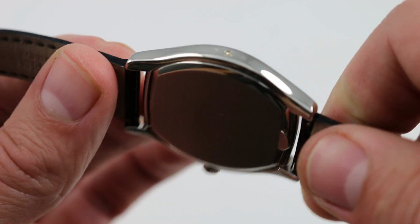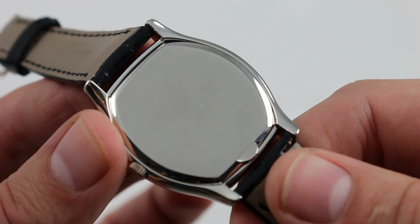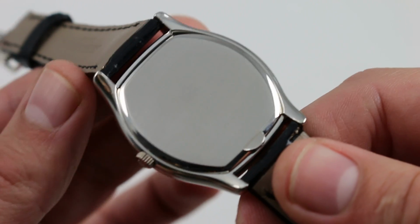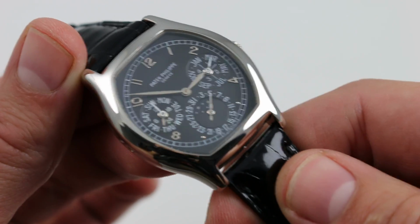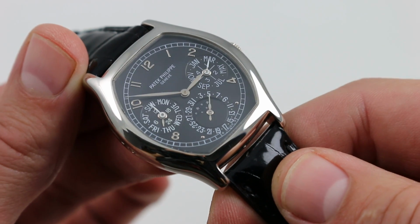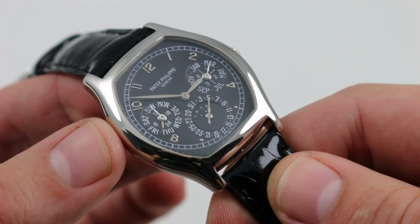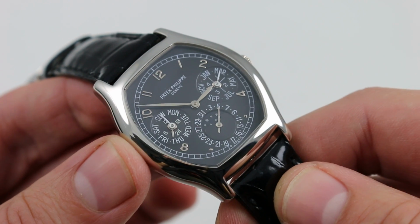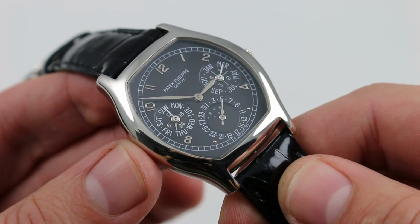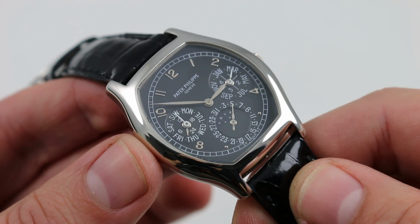Now, underneath that snap-on case back is a Patek Philippe automatic micro rotor caliber 240Q with a 45 to 48 hour power reserve when completely wound, a 21,600 vibration per hour beat rate, and Patek Philippe's signature Gyromax style free-sprung balance. For added resistance to shock or vibration-induced timing deviation, Gyromax, a Patek Philippe innovation, also allows the watch to take and hold a very precise regulation.